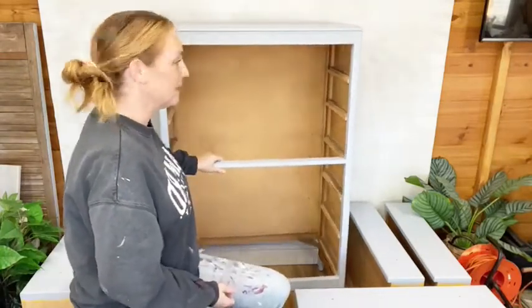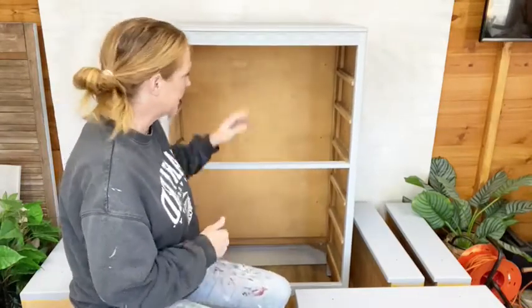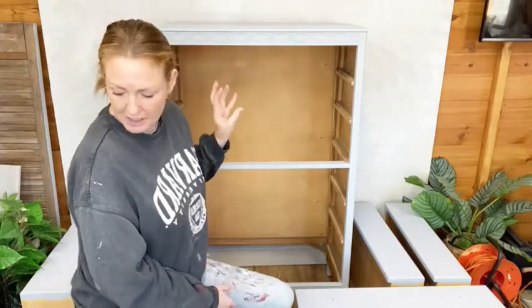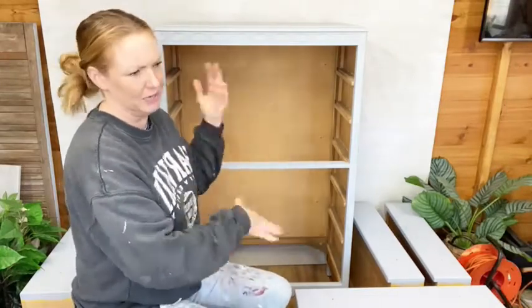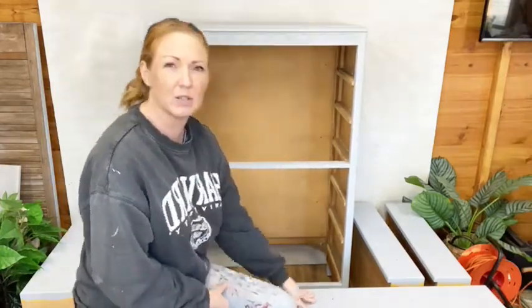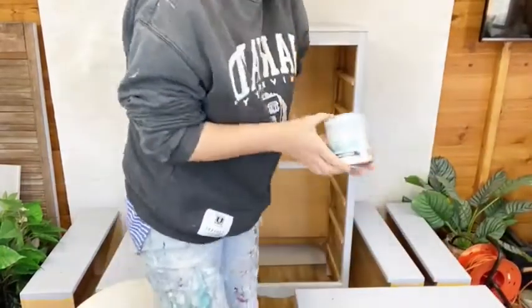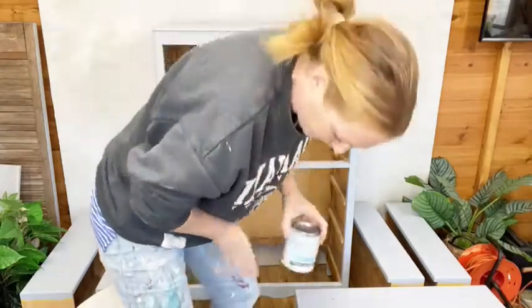These Lebus sets are really, really popular to be painted. This one is a six-drawer set, but I've found historically every one I've worked on, once it's clean, it just keeps on bleeding. They are oak with bits of veneer; the drawers are pretty solid, but the best thing to do is prime them. This one has had two coats of the Sure Prep stain-blocking primer in the grey.